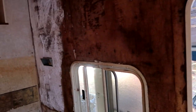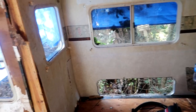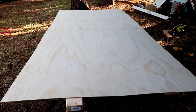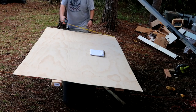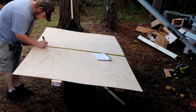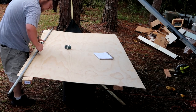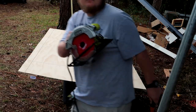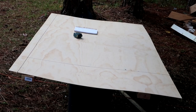We just finished peeling off the rest of it. It's a little damp in here. Maybe if we got time we'll do this one as well, and then that's it for interior walls other than the bottom portion of the slide. We're trying to get all that done just to make it look a little better, a little more finished. I'm gonna show you how I'm cutting this stuff and show you what exactly we're using. So here we have our Luan paneling - it's an eighth of an inch thick. Redneck sawhorse. Now you can see I have all my lines and measurements cut out so I only have to cut it all at the same time.